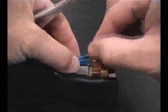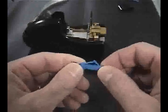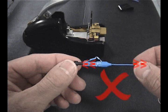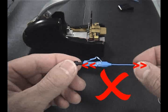Remove the connector by opening the small securing lever and lifting the connector straight up and out of the tool. Finally, slide the boot back up and gently press into place while holding the connector housing. Never pull on the fiber to engage the boot or while holding the terminated connector, as this can cause a gap at the splice joint resulting in excessive insertion loss.